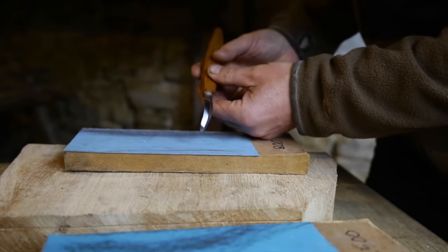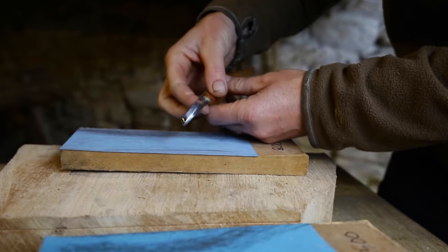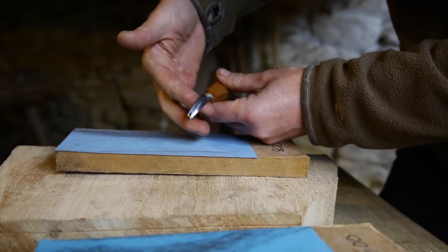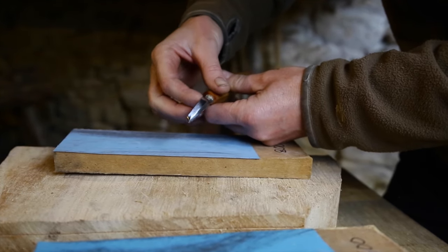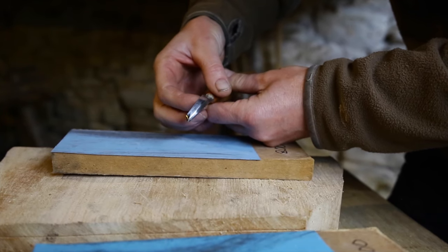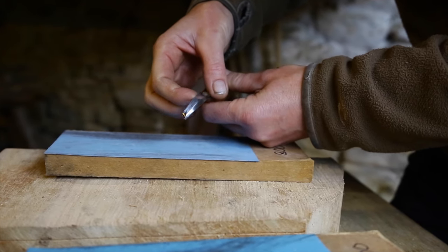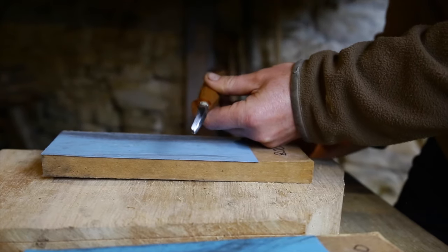What we've got to do now is find out if we've removed metal all the way to the edge — that's the crucial thing. The first way I test for that is feeling for a burr. Dragging my finger carefully away from the cutting edge, you can feel just a tiny little burr, like a little hook on the edge catching at your finger. If you feel a burr all the way along the edge, you know you've removed metal from the edge.